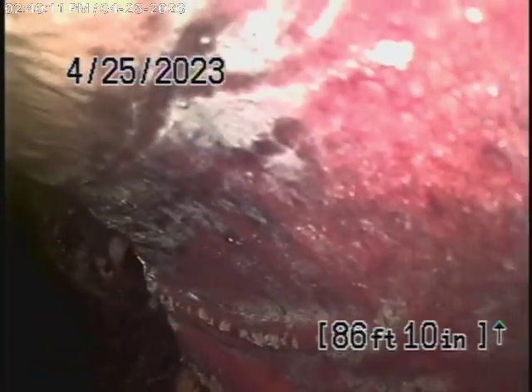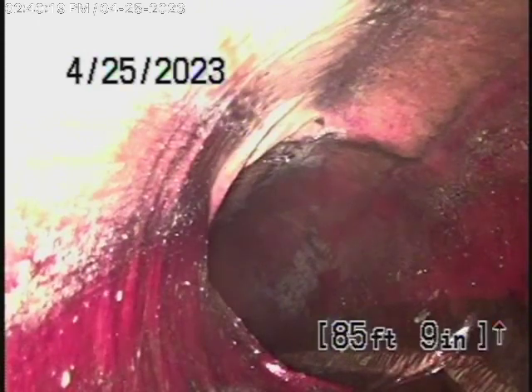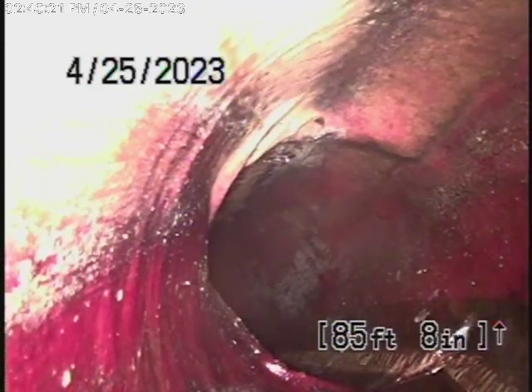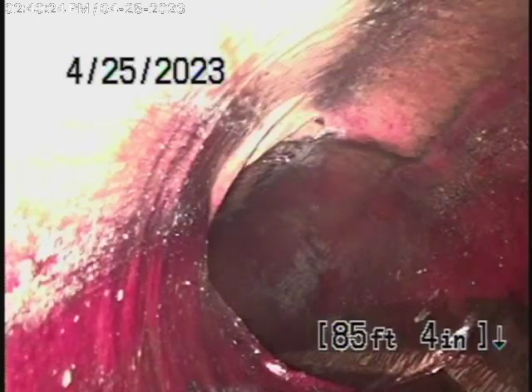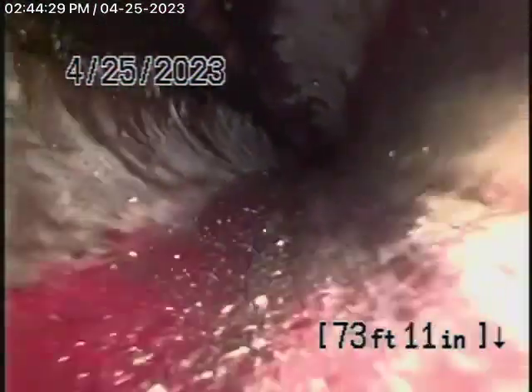It's actually a lining here that's not really an approved line. This is not an approved lining for the City of Los Angeles. I'm going to locate the spot. You can see roots getting in at the end of the line. The rest of the lining looks okay, but this is not an approved lining, you can tell. And I doubt there was ever a permit taken out on this when it was installed.